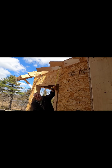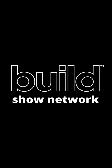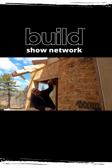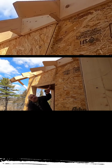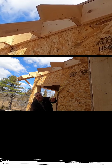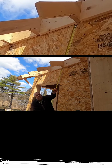So we had to plan for all that displacement of the rafter tail. Hey, funny meeting you all here. Well, welcome to the window. We're outside and you can see here's each of those rafter tails coming down. Notice the extension of that seat cut, how it comes out. Well, that's because we have rigid insulation and a drainage plane and rain screen and a bunch of things happening out here that are actually gonna build out the wall.